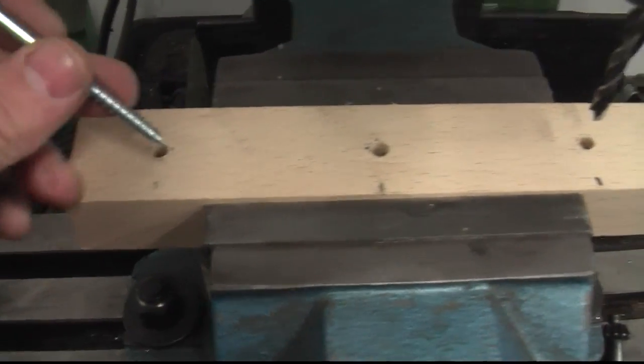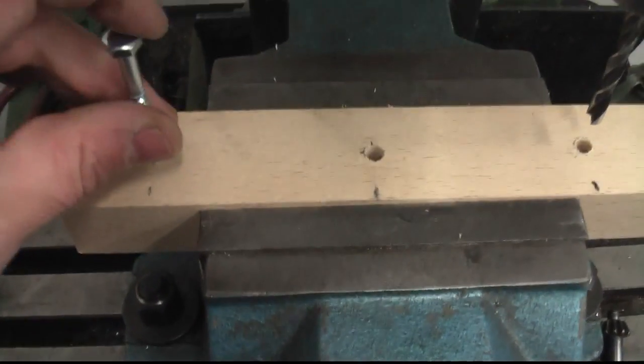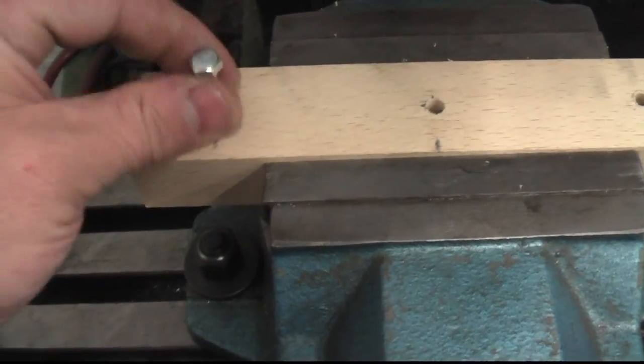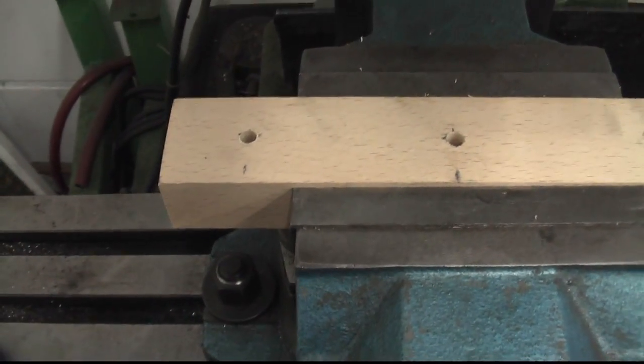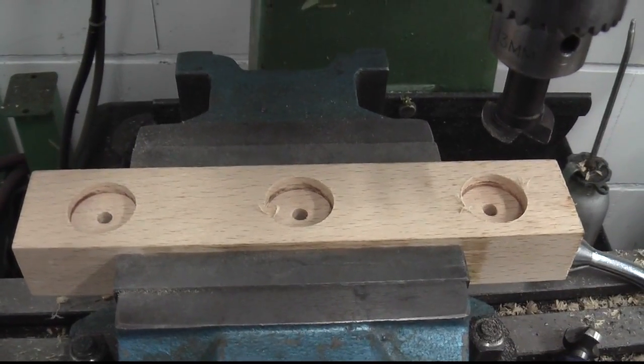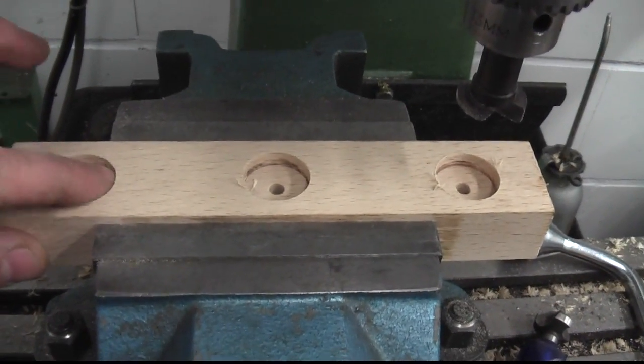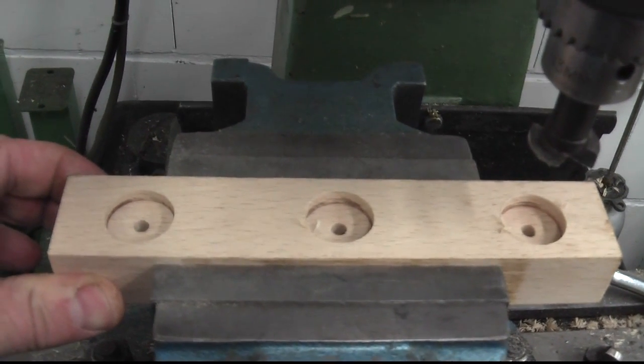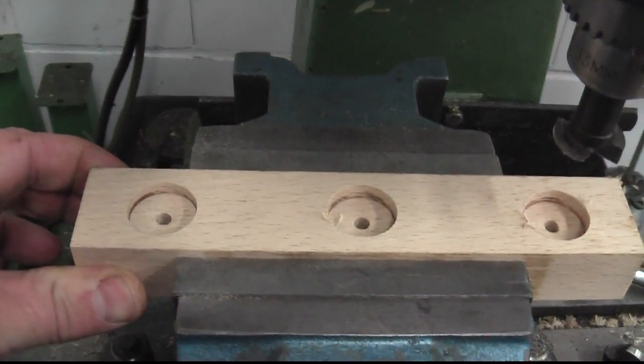Next we drill 3 holes through the markers so that the screws will fit snugly through it, 6mm in this case. So in this next step we have drilled the 1 inch holes 7mm deep from the other side. That is so you don't see the machine head of the screw later on.